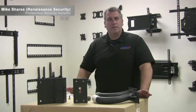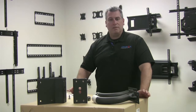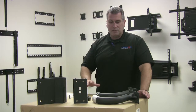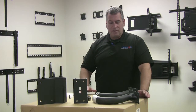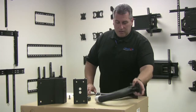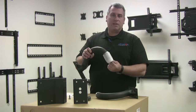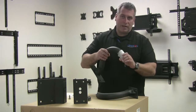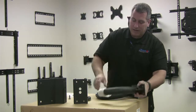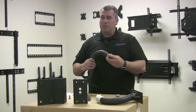In this section of the video we're going to talk about the Crimson AV security camera mounts. I'm a long time installer of cameras and I like this product because it's really easy to install. It has some basic standard things. The RW12 standard dome camera comes in a box. We protect all the threads so you're never going to get it where it's nicked or hard to thread on. It's a standard inch and a half MPT thread, so it should go on most cameras.